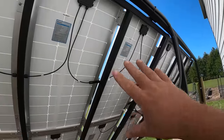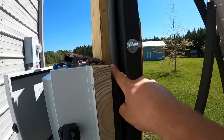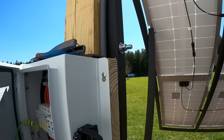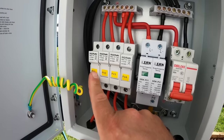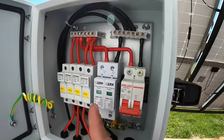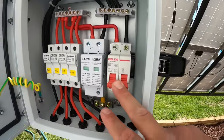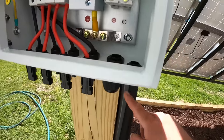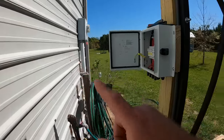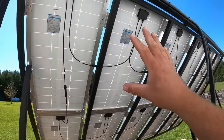On the back side of this solar array I have everything wired up. We have videos on that — it comes down to one set of 10 gauge wire that comes down this post. I'm about to cut and take this 10 gauge wire from this solar array into this combiner box on my first string. What we're accomplishing with this box is surge protection — we're out here in Florida, lightning capital of the world, and this is exposed. We're also going to get breakers and fuses, then output the wire back into my shop into the solar room. We can change combinations out here depending on what I'm testing for wattage, voltage, and amperage.